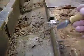Okay, and the board has gone from this stringer on this side. And the board is gone on this side. I'm hitting the foam back here right now. So all the way from the back, we were expecting, or hoping, that we'd have just some rot in the back in here. Okay? So if I was to crawl in here, I can show you that on this side, I still have rot. I'm crumbling away pieces of that stringer very easily. This side, I actually have a little bit of rot. I've got rot down here at the bottom.